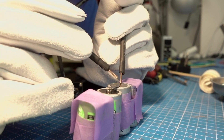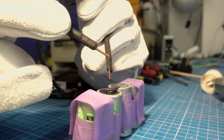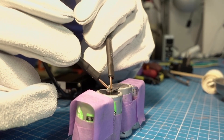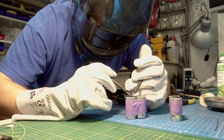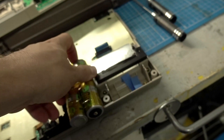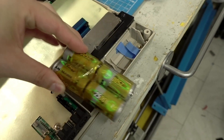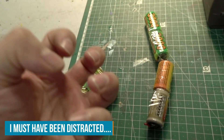Welding up the battery pack is pretty cool. Here's a pro tip: never rip off the contacts when you get scared — that will only lead to more sparks and fire. Keep your calm and do one point after the other, and don't be afraid of the sparks. Test fitting the battery pack leads me to conclude that I'm a little bit dumb, because I ordered the wrong cell size from Element 14 — I got these cells instead of Sub-C. So now I have to wait for more cells to build up that battery pack again. Hopefully then we can try to boot up the machine.